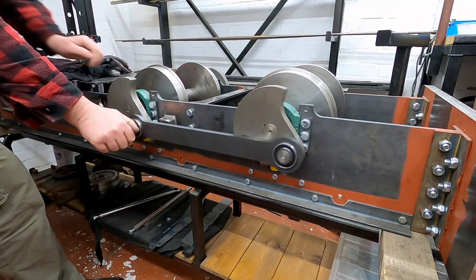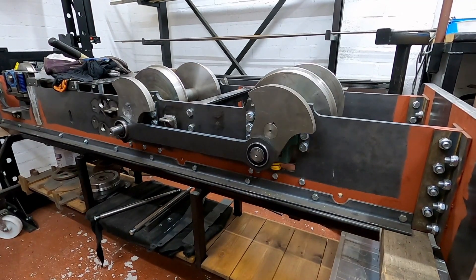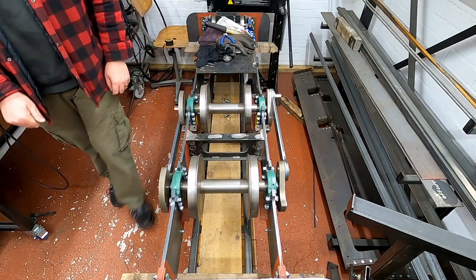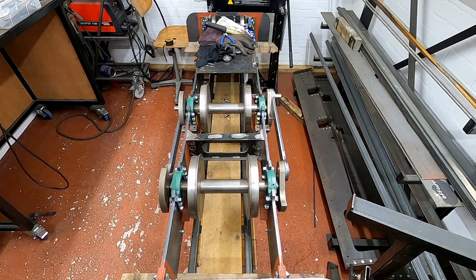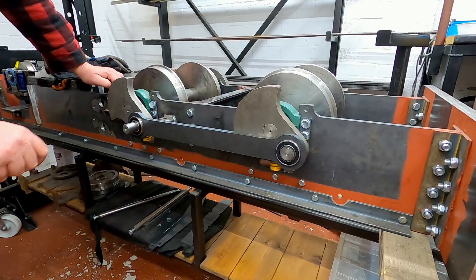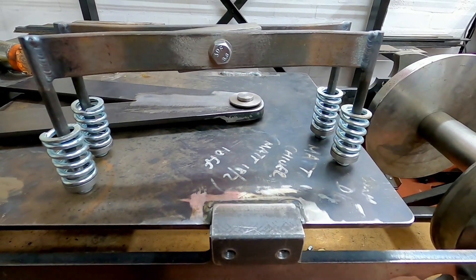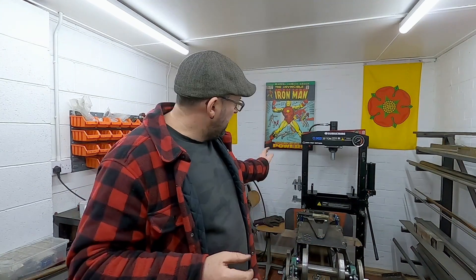We're going to install the rear arm. Now that we have the cranks on, the crank pins in, and we've checked everything, and we've got the horn guides in, we're going to get the rear suspension in. The rear suspension is slightly different — when I say rear end I actually mean the rear driving axle. The reason it's different is because the engine is very back-heavy, so we need to sort of push the back end up. Hence all the work on the pony truck, which obviously took a very long time to do, but it's done, it's in, we should be good. So now we need to make sure that the rear driver pushes up as well.